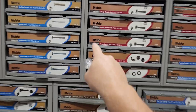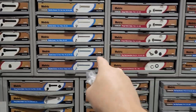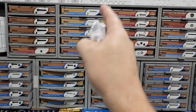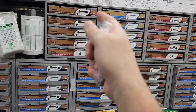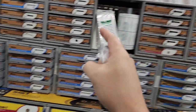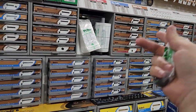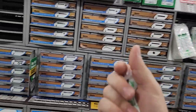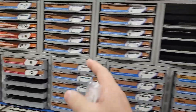They have metric and standard. Notice how all your fasteners are labeled if they're stainless steel. If you're working on medical equipment, use stainless steel. These ones here are black oxide, but that's because of the purpose for these ones. Use stainless steel — not only is it a harder metal, but usually they're machined a little bit better. And at the same time, you don't have to worry about the galvanic corrosion that you have to worry about with many other metals.